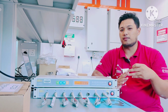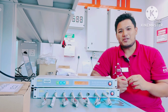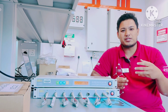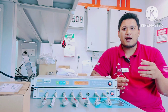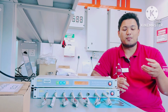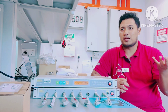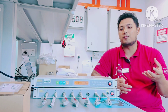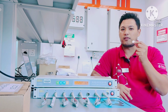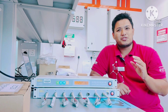Researchers can study each of the elements or components to enhance the performance of the coin cell. For example, in this lab what we did is study the composition of the anode — we tried to find a new composite material. Nowadays there is robust synthesis work on MXene; we try to incorporate MXene with other materials, for example activated carbon, to use as an anode in this coin cell.